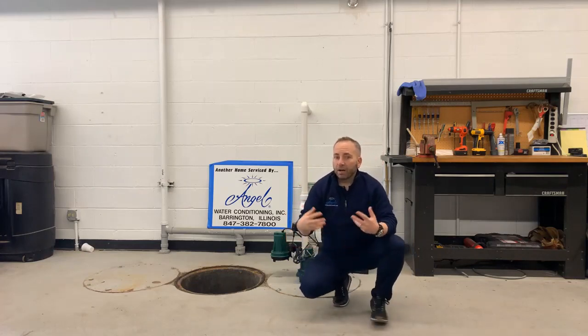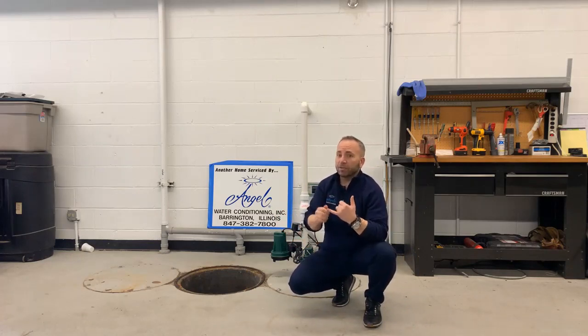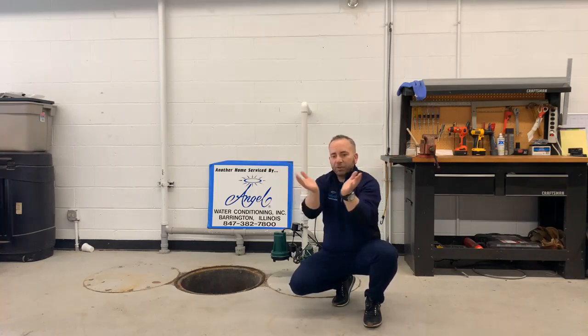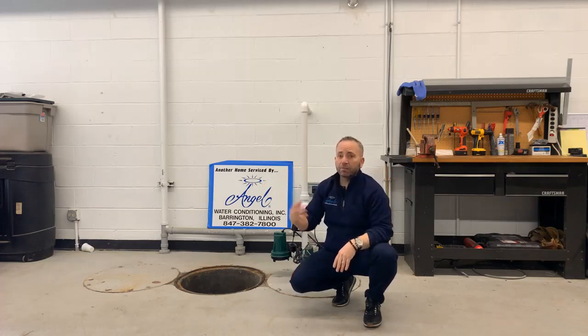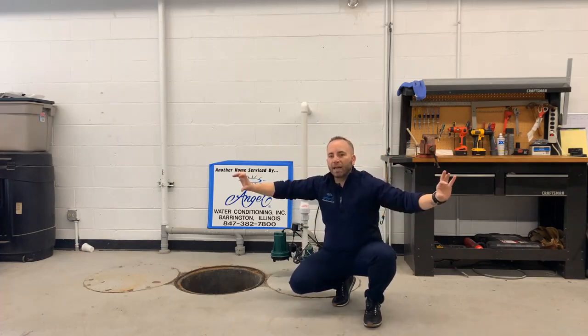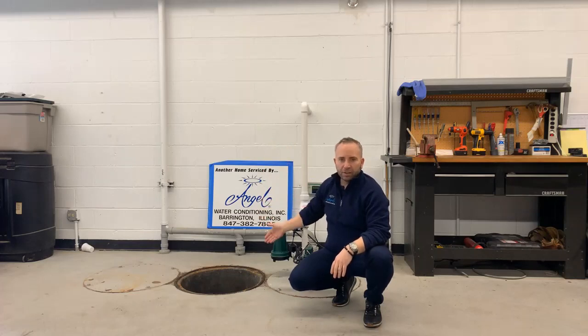You can talk to a landscaper to make sure you don't have a swale pushing water toward your house during heavy rain — a landscaper can possibly pitch it away. That's one big reason we see basement floods. The other reason is gutters not pouring away from the house. We don't want to bring extra water down into the drain tile because it puts extra pressure on the pump, which can usually handle 35–50 gallons per minute depending on horsepower.